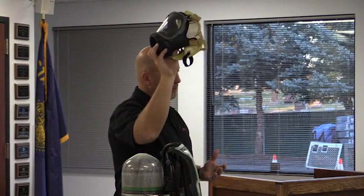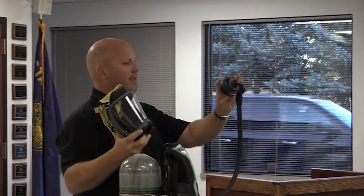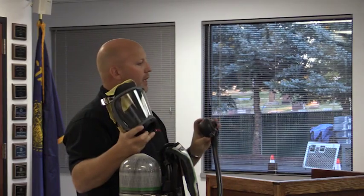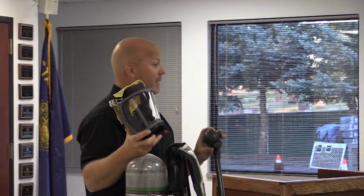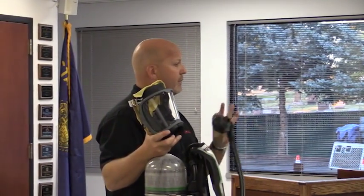Why I bring that up is after you're done using the SCBA, the only thing you need to sanitize is the face piece. You do not need to sanitize the second stage regulator. Note I used the word sanitize, right? Sanitization is killing the bugs. Cleaning is a whole different topic.